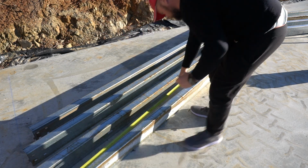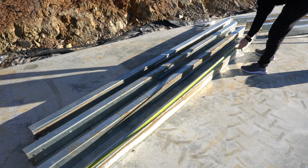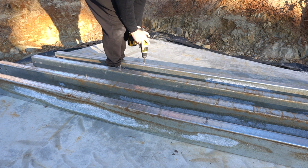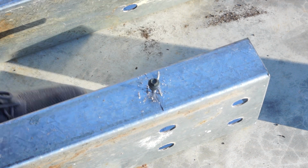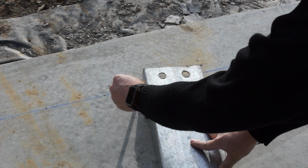After orienting the trusses, I'm half drilling Tek screws at specific intervals along the top edge. This will face the sky, and the screws will come into play later when we lay in the roofing top hats. Measure spacing accurately, as you'll need to know where these top hats are for roofing. Using the slab, I'll measure a template to get consistent angles for each truss.